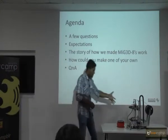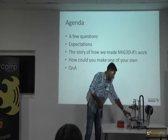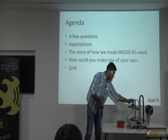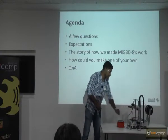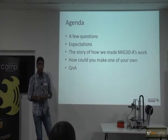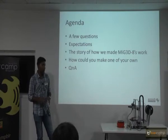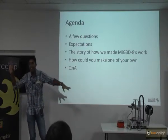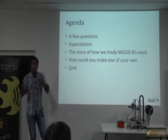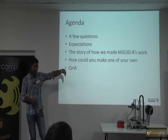You would have to look at how much is your Z axis length, and how much is the length of your Y and X axis — here it is driven by a belt on X and Y axis. My X axis, my Y axis, and here is my Z which is driven by a ball screw. All of those axis lengths you will have to get right — that is done purely by trial and error, because your mechanical would never be exact. If you build a 10 mm piece it will be 10.01 or 10.1 typically. That is the whole thing — that is probably how you can do it, and we can help you out.